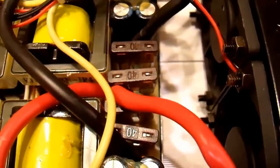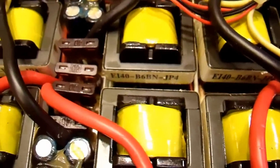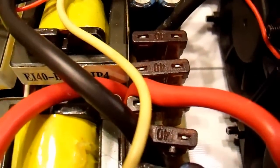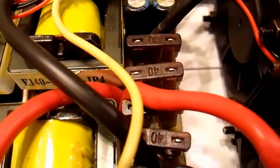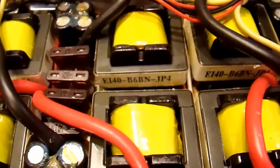It looks like it's already rusting a little bit from that damage. It is fused, which is good — probably has to be to not be a fire hazard. There are four 40-amp fuses over here and four 40-amp fuses over here — that's 320 amps total. Once you consider the efficiency of this inverter, that's going to be just about enough for 2500 watts, which means the surge rating they advertise is not true — typical of inexpensive consumer-grade inverters. These are automotive blade-style fuses and they do have fuse holders, so you can replace them, which is good. But it will limit output to 2500 watts — that's all you're going to get, so the surge capability is 2500 watts.